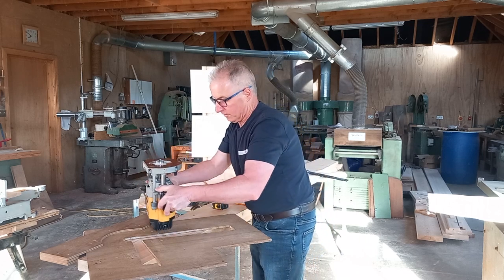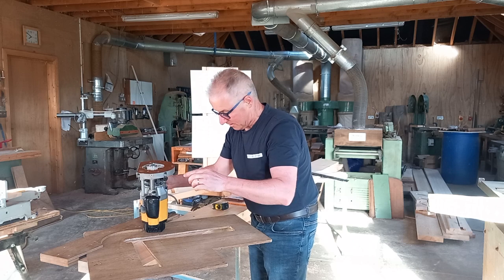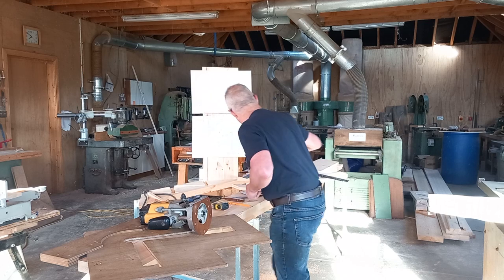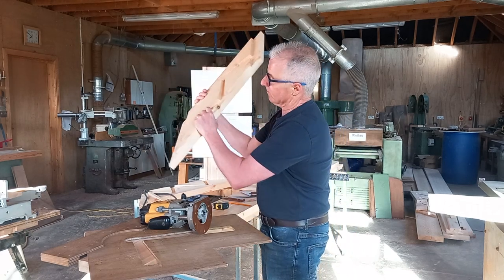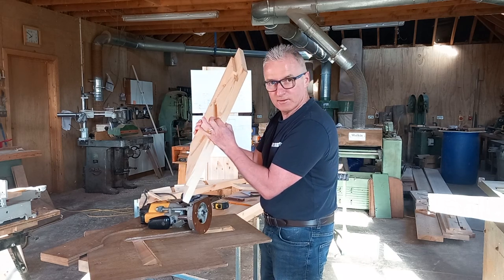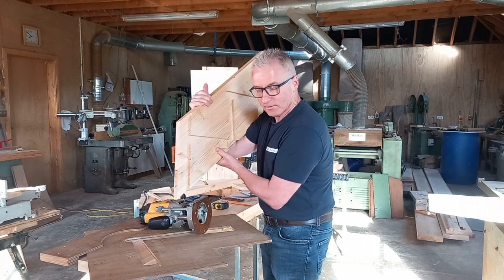We set the depth of the cut for the trench to around 9/16 of an inch. So that's about 14 mil. And that's what I'd normally use. Some people just go 1/2 inch. So there's the actual depth. In my case, it'll show about 9/16 to 14 mil, and that allows me 25 mil here as a bare-face mortise when I come to do the newel post later on. You can see that I've already done it on this stair.